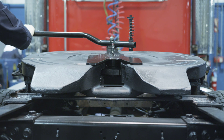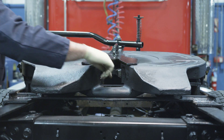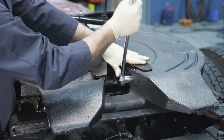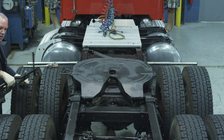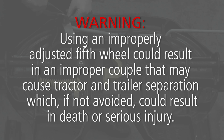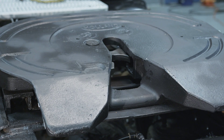If there is a large amount of fore and aft movement with the adjustment tool when verifying the adjustment, check to make sure the lock is engaged on both steps. If the lock engages only on one step, loosen the adjustment bolt until it is flush with the end of the nut, then repeat the previous procedures of lock adjustment. Remove the tool by unhooking the J-hook from the front skirt and rotating the handle to the center of the tool. Firmly grasp the tool with both hands, slide back, and carefully lift it off the fifth wheel — do not drop the tool from the tractor. Using an improperly adjusted fifth wheel could result in an improper couple that may cause tractor and trailer separation, which, if not avoided, could result in death or serious injury. Never use a fifth wheel that does not operate properly; contact your nearest SAF Holland representative for assistance. The Holland FW8 lock adjustment procedure is now complete.